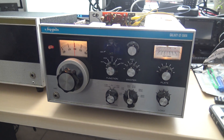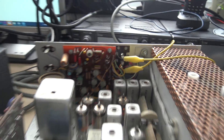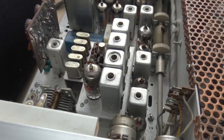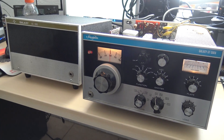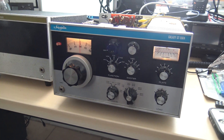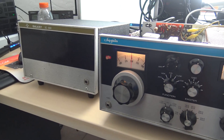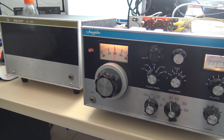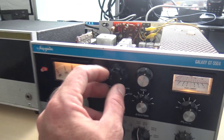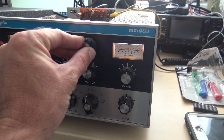I am planning on going through this radio. In the meantime, what I plan on doing right now is hopefully getting that wire soldered so I can put the cover back on. Maybe I'll hit it with some compressed air and blow it out. I'm going to wire up this D-104 and get on the international phone contest this weekend — get on there and work some DX with this monster. Hopefully I get some power output. I can hear it's already drifting; it hasn't been warmed up that much. I haven't done the tune-up procedure — I'm going to check all that.